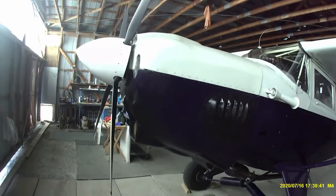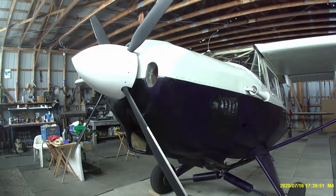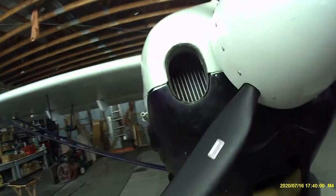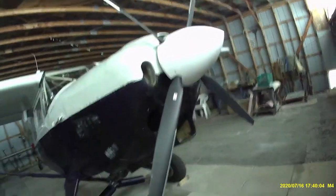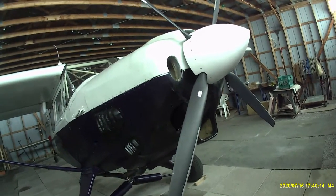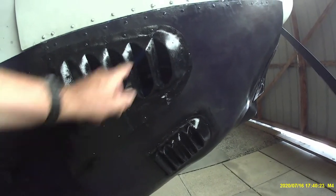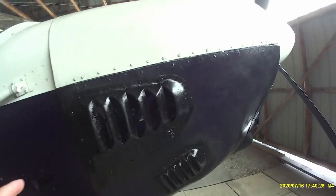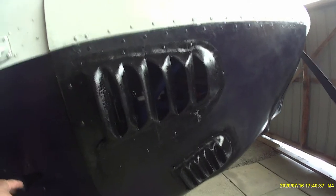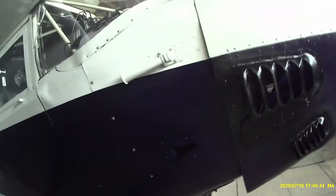Historically with this machine — I've been flying it for a few years — I've been reluctant to make drastic changes because everything you do affects everything, not to mention the fact that everything has a cost: time, weight and balance, etc. I've had the components in the engine for a while, just took my time getting around to it. From the previous videos, I had a set of louvers here but they were larger. What I didn't point out in the last video is that the exit area of these louvers was extending all the way down, and I was getting hot air off the engine going into my cold air intakes. I have other cold air intakes in the windows which work very well — these are not working all that well.